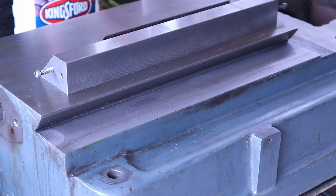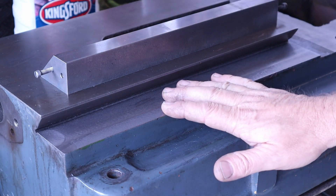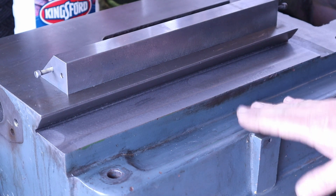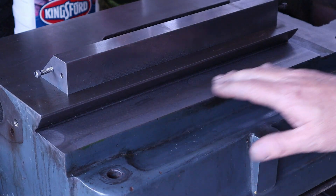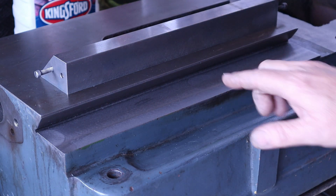What we've got here is the milling machine base for my import milling machine. I had a problem — I had scraped in this side, lightly scraped in the other side, put my sled on here, and this side was eight thousandths lower. So I was able to take this machine to a friend's mill, set it up, and got it as close as I could possibly get it, milling the decks with a dovetail cutter until it was pretty close.